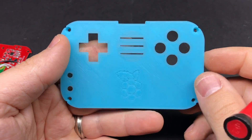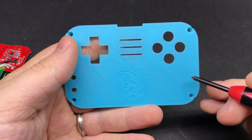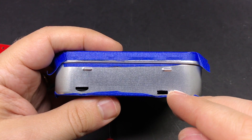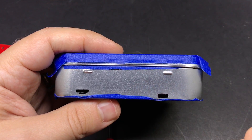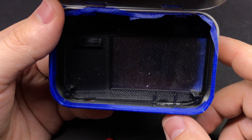There are a few options for where you can add that button. One thing I've seen somebody on the forums do is drill a hole right here opposite the start and select button holes and just add another tactile switch right there. The other option is to add a hole on the front of the tin somewhere — I think right here next to the power switch would be a good spot, so you could put your tactile switch for the shutdown pin right there beside the power switch.